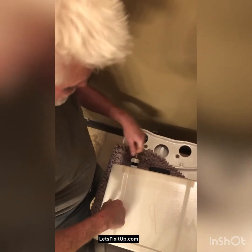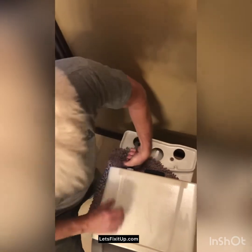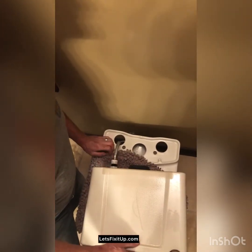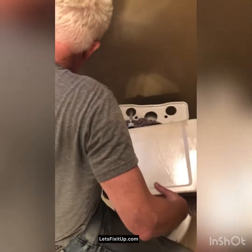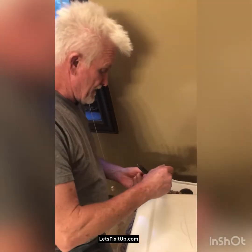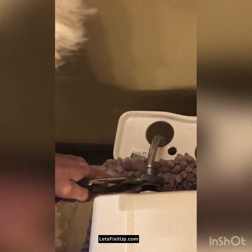And I want to get it good and snug, hand tight. One person's hand tight is not equal to another person's hand tight, but we want it on there good and snug, but not so tight that we crack the plastic. I'm going to take my channel lock pliers after it's hand tight, and I'm just going to give it about a quarter to a half more turn, maybe a little more, making sure that we don't overtighten.